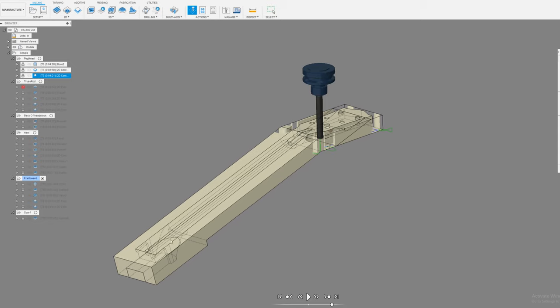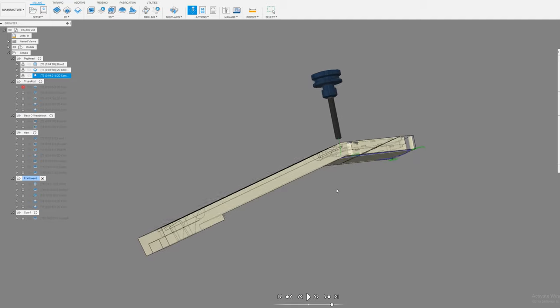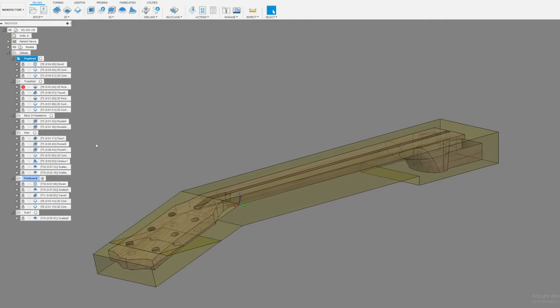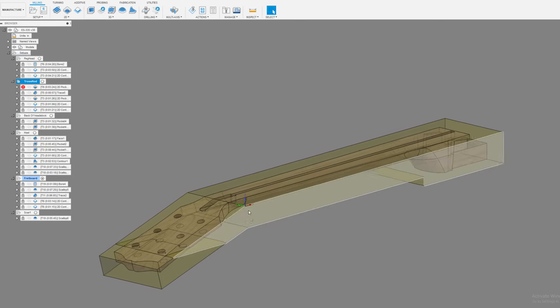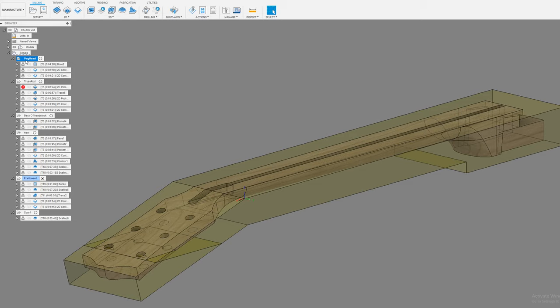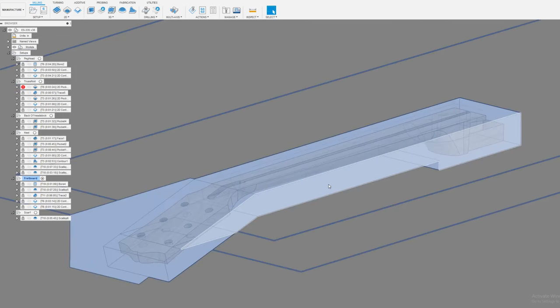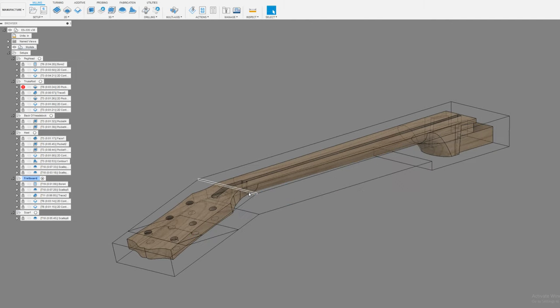So on this neck, because I have this extra heel area, I actually glued in just a piece of MDF that I put some tape and super glue to hold in here in this space so that I could flip the stock around like this. And then I have this truss rod. And so I'm indicating from the exact same point. You see, the peg head is there, the truss rod is there. So same point, you're gonna indicate off of this face, which is up against that milled surface that you put on the CNC bed, and then off this scarf joint again.